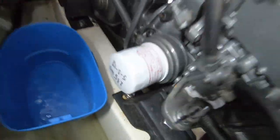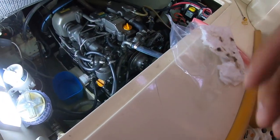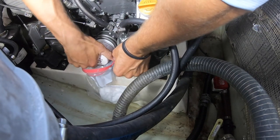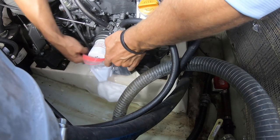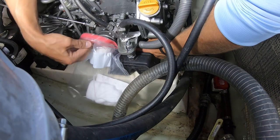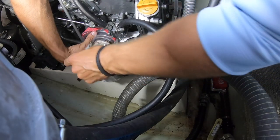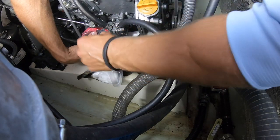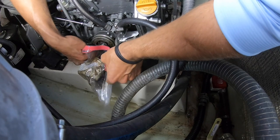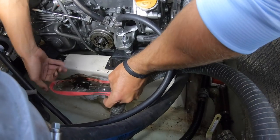Anyway, there's your Yanmar filter. I'm going to put it in the bag and unscrew it. Get this ready here — I want to get that thing broke loose a little bit. Now I want to make sure the bag is under here a good ways. You will have to kind of screw just a little as you go. All right, now it is off. We want to let it sit under there a little bit longer to drain.